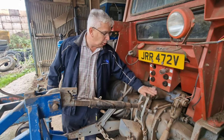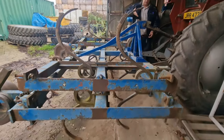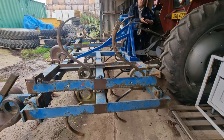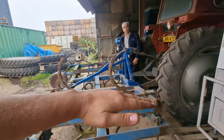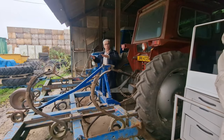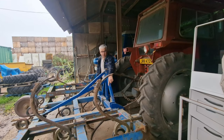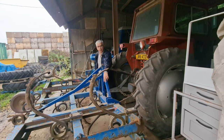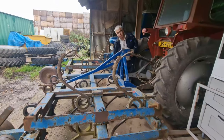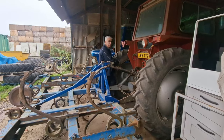It's working out the pull on the arm here to calculate whether it needs to lift or lower. If you imagine that's your hand wedging into the ground and the weight of the soil is on top of that, and you're trying to break that up - on a subsoiler with big wings on, the force is down into the ground. So it does guide itself in and it does stick in. The tine is trying to dive into the ground, trying to go further down. So this then lifts that up, and by lifting that up, it transfers the weight onto the back wheels.